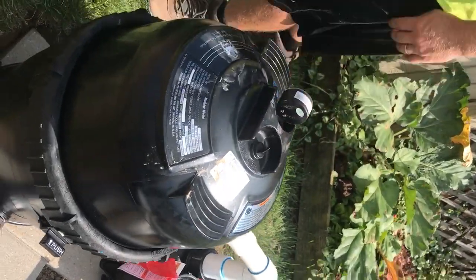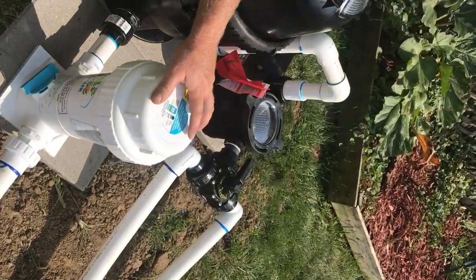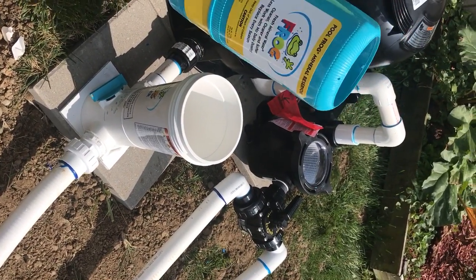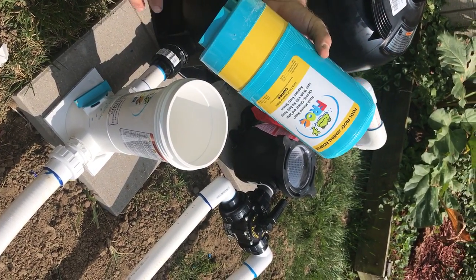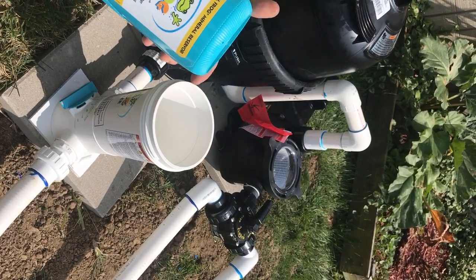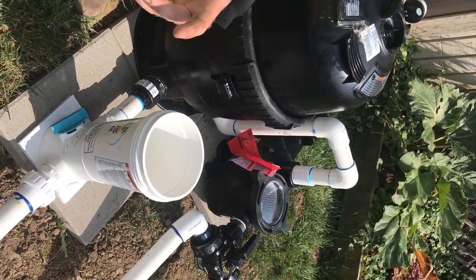Your chlorinator. This year, if you're not going to be swimming in it much, what we recommend is they give you a startup kit. There are chemicals in here called the mineral reservoir that's going to last you about one full pool season. If you were to keep this in and turn your pump on as soon as water gets in it, the whole thing's ruined. So what we're going to do is take that out and just balance your chemicals manually. You're only going to have a week or two max, so there's no point in wasting it — it'll cost you about a hundred bucks.